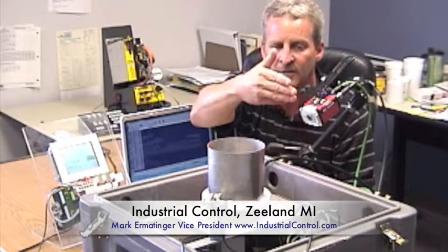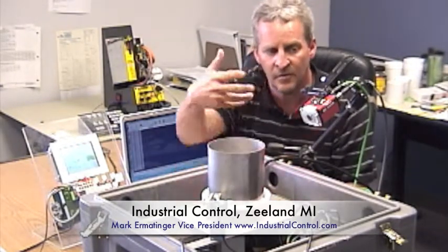So we've got the speed, we've got the liquid lens, and we also have the package. It's a DC powered unit with an IP67 rating — fully sealed — which will keep all the dust and debris out. Some of the older cameras don't have good sealing and we've had issues with that, so this is going to be a great addition for use in those tough environments.